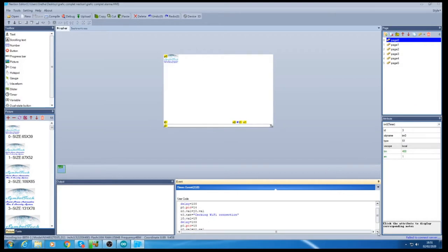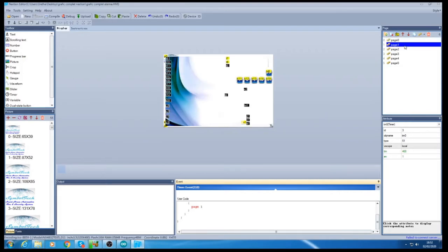So it's stopping over there until it receives the command from the Mega that they connect to internet through the ESP8266. Once it is connected, we're going to show on the screen Wi-Fi connected. Then we go over to the process. We're going to process all this stuff, put the menu, graphic and stuff like that together, and then jump to page number one, which is this one.